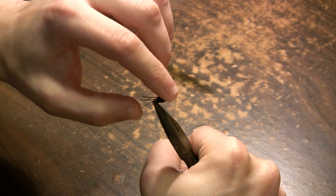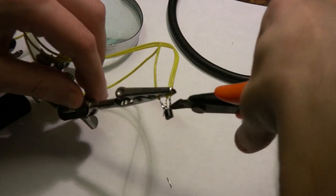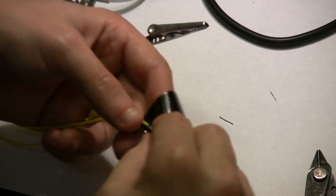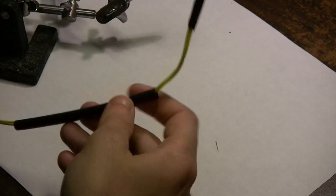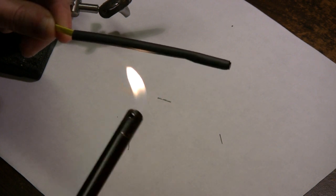To measure the temperature of the water, we made waterproof temperature probes. We basically took the LM34 temperature sensor that ships with our nerd kits and soldered long wires to it, then applied heat shrink to the whole thing. We used a special type of heat shrink that has glue on the inside to help with waterproofing, but you can just use a little super glue over the edges if you don't have this type of heat shrink.